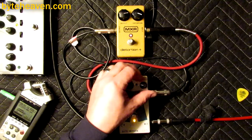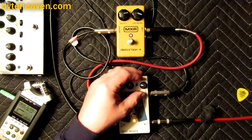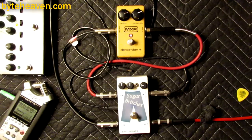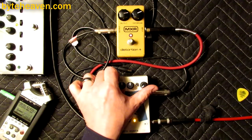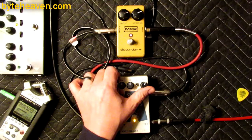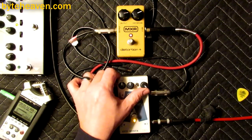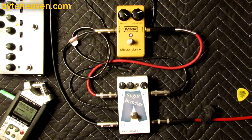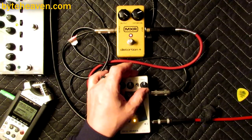I kind of like that. The thing about a distortion unit style pedal with a crossover blend is that as you raise the crossover frequency, you remove bass from it, gradually turning it into a tube screamer — more or less. Without the de-emphasis, it stays pretty bright.